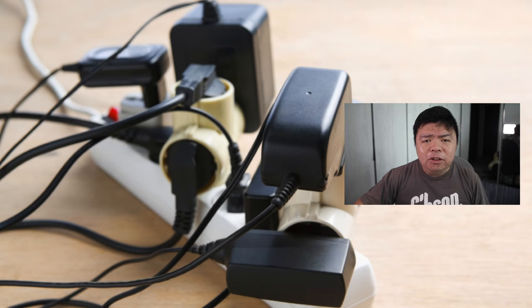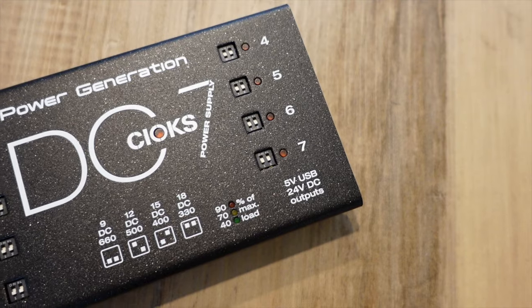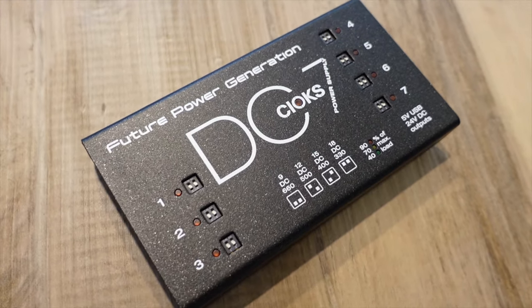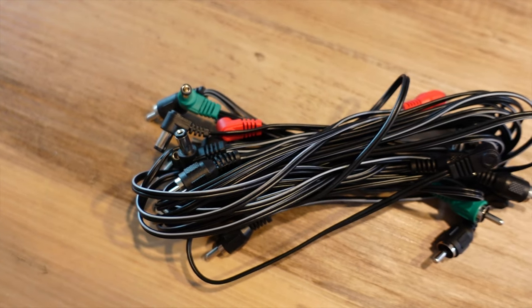I was very wrong. It was still very noisy, particularly when I had a power-hungry pedal like the Iridium in the chain. I then tried using the power supplies that came with the respective units, plugging several power supplies into a multi-plug adapter, but the noise persisted. Not only was there noise, I had a nasty surprise electric shock from my guitar strings. When that happened, I removed the daisy chain. I was going to need to make another purchase. Enter the Truetone CS7, a power supply that Jimmy Cooper of Haywood Guitar recommended due to its low profile and extensive power capabilities.